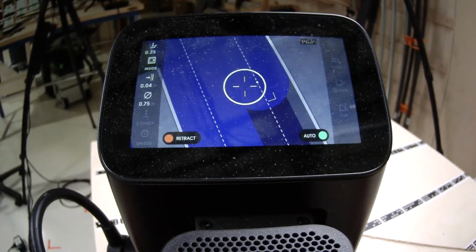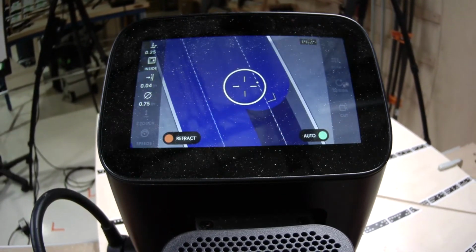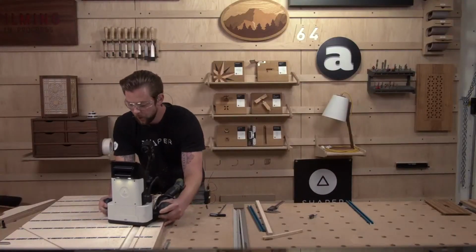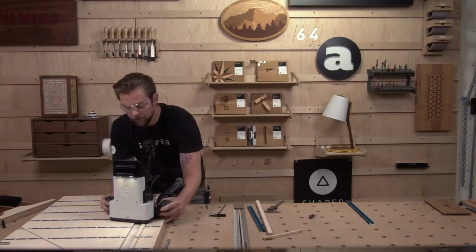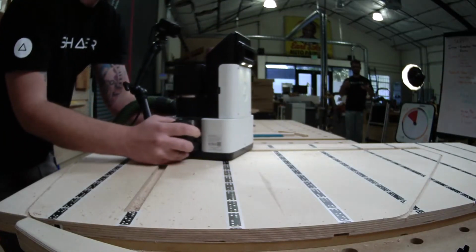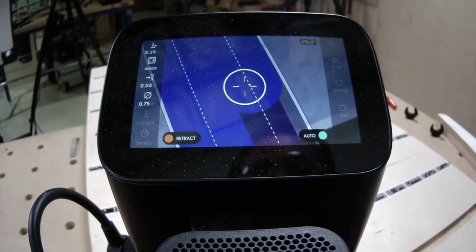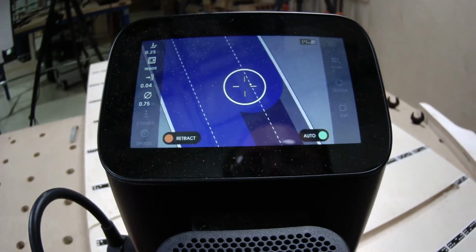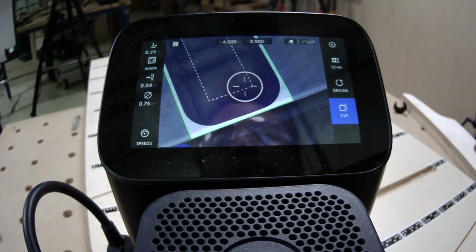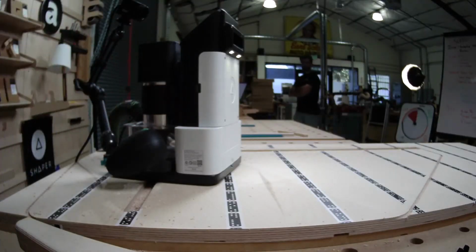But ideally you remove less and less material as you come closer to your ideal dimension, so that the less material you are removing, the smoother you are using Origin. Origin is, at the end of the day, human and robotics working together. So the smoother that you operate the tool, the smoother your cuts are going to be. And he's just coming back here on the back side of this inside cut. Yeah. Let's brush it out and see how it fits.